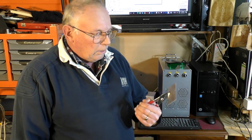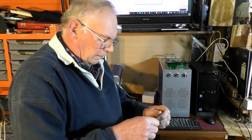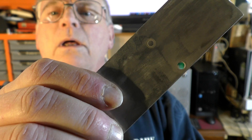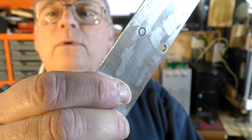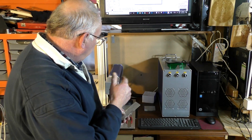As you can see, that's nearly one and a half millimeters of aluminum, and I did time it — it took three and a half minutes. Which is, you know, it doesn't make much sense practically; it's quicker to just drill a hole. But it's really just a demonstration. Look how clean that hole is — beautiful, isn't it? So to answer the question: can a fiber laser drill a hole? Yes it can.